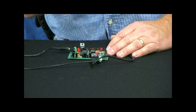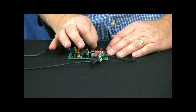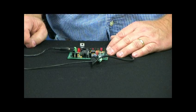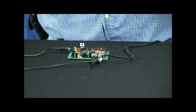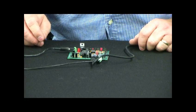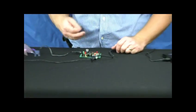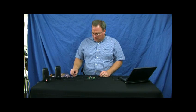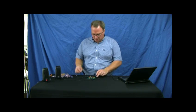Okay, and then it's done and waiting for another trigger. If it gets triggered again it's going to go back to the first message. In multi-message mode you could have as many messages as you can fit on your chip. On this model we have 80 seconds of recording at this quality, so we could do eight 10-second messages if we wanted to, and it would loop through every one of them — every time it's triggered it plays one, then stops, then the next one.